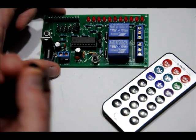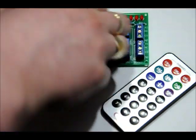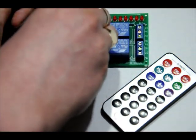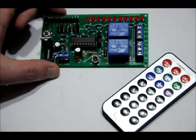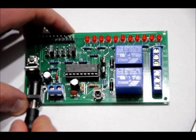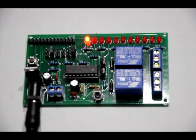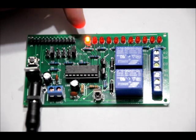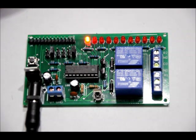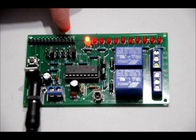So what I'm going to do is place a two-pin jumper on the B two-pin header, and that's going to enter us into latching mode. Let's try latching mode. I'm going to plug in my AC adapter and press the 0 button. The 0 output went from 0 volts to 5 volts, and it did on the indicator too. So this pin is actually high right now. If I press it again, it toggles low.